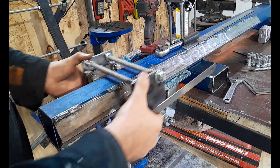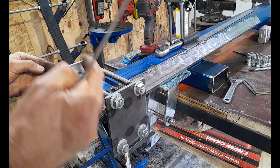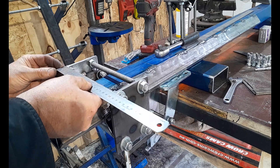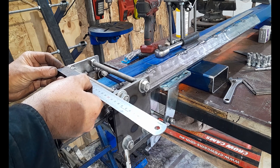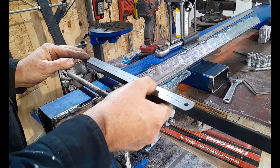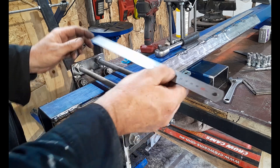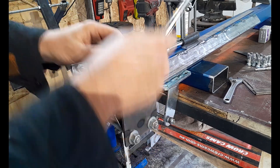What I do is measure from outside plate to outside plate. In this case I'm at 200 millimeters exactly from outside to outside of the plate. Check all around, and that's a matter of getting that to marry up by adjusting your jam nuts versus your outside nuts.